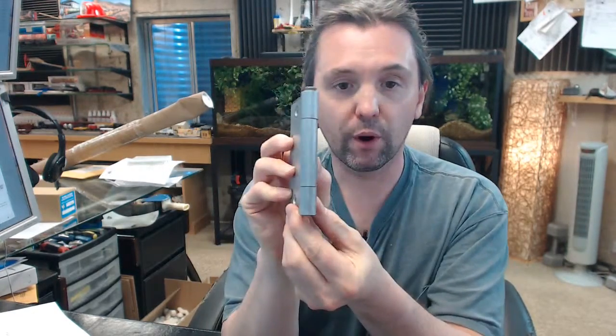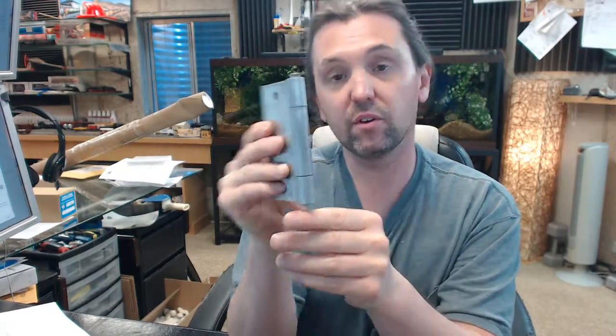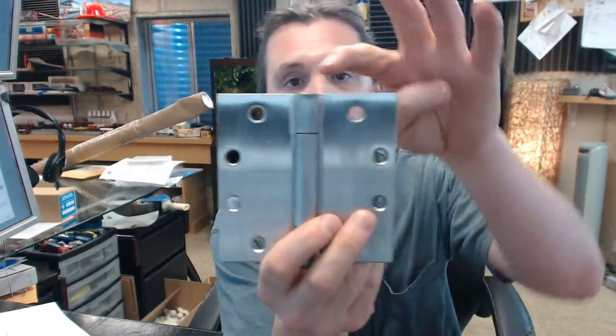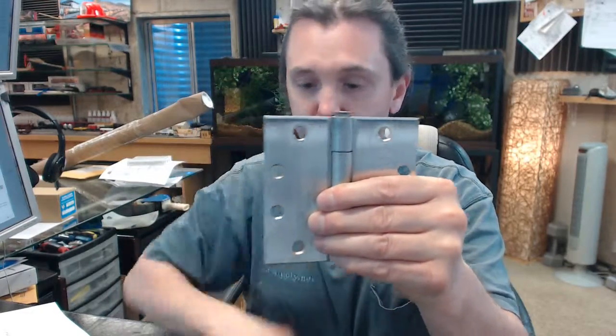A very appropriate hinge for any exterior application where a bit of aesthetic difference from a standard five knuckle hinge is required. Hollow metal doors are going to use these — a hospital, exterior steel doors, loading dock areas would have this or its thicker heavy weight version, which would be very typical as well. What people also like about this hinge is the flush condition on the knuckle or tip assembly. Once you seat that pin, it is going to be all but flush.